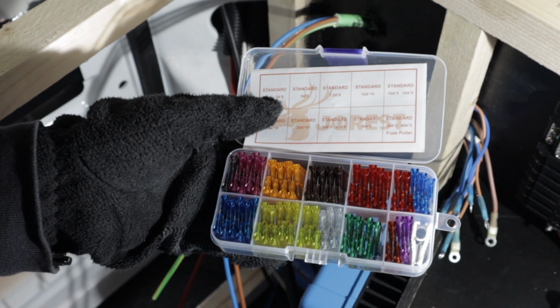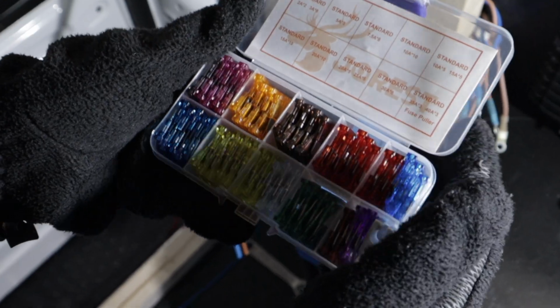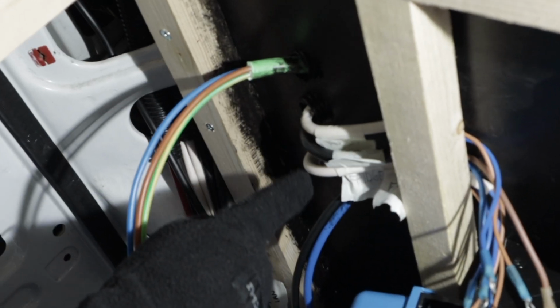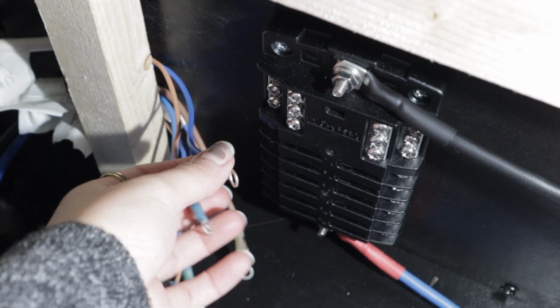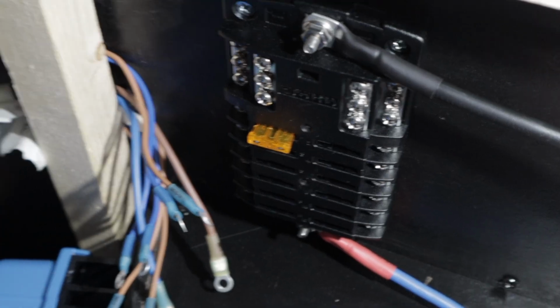And we're going to use the reading lights to test if our 12-volt fuse block connections are working properly. Alright, so we're going to go with the 5. It's this one. 5. Yeah. I think it's the top one, if I'm not mistaken. Reading lights. It's this one. Reading lights. Okay, so these are the wires. We're going to connect the negatives to the top here and then the positives to the bottom. The fuse is in.